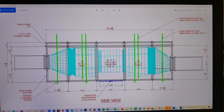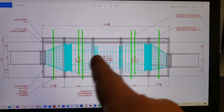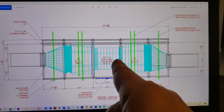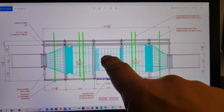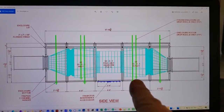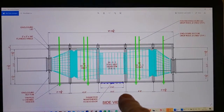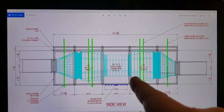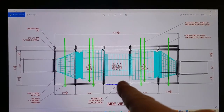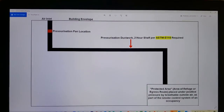Being that neither ISO 6944 nor 2816 put thermocouples on the inside, we don't have data in terms of how much heat arrives on the inside of that ductwork. We only know what goes through the fire stop portion and onto the unexposed side, where they're using the oldest trick in the book in order to get a favorable rating. Now, they're not lying, right? These vendors, they're giving you results, but my point is make sure that you know what it is that you're getting by understanding the test regimen, right?